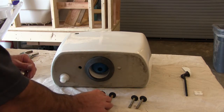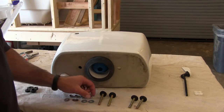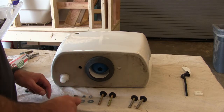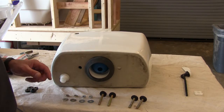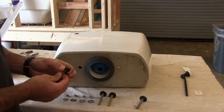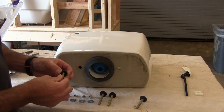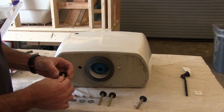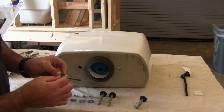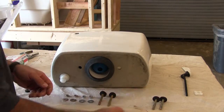You typically need — sometimes three — there may be three fasten points on the tank, but at this point we only have two. So we need two sets of washers and two sets of nuts. We only have two bolts here. This is an old one where the washer has been squashed and probably cracked a little bit, so I took them out and I'm going to completely replace them. The top of that bolt squashes down into the washer and seals it, and we have to have that so we can fasten the tank to the bowl.